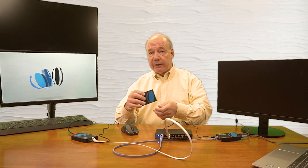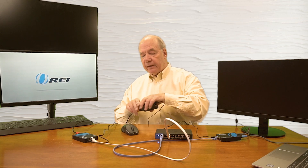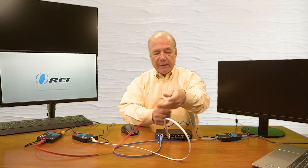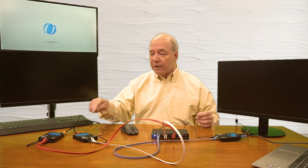That'll re-establish the connection and the video will come up in a second. Now if I want to expand that to multiple receivers, I'll need another receiver and another power supply — I happen to have another receiver right here. I'll connect up the top monitor to this one, add power to it, and then all I need to do is add this to the switch. I'll plug a LAN cable into the LAN port on the second receiver and plug it into any other port on the switch. After a moment for adjustment, you'll see the same content on both monitors sent from the primary side simultaneously. Whether it's a sports bar or a presentation with multiple monitors, you can cascade that same output to multiple monitors while still preserving KVM functionality from one of those remote locations.